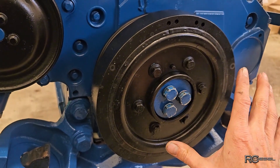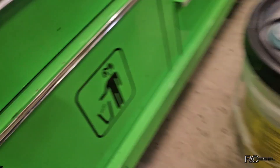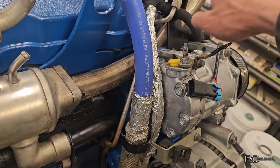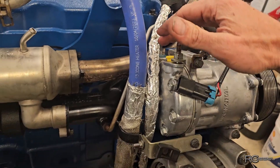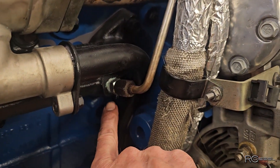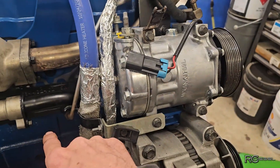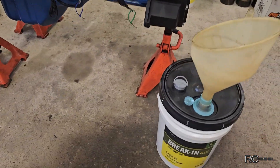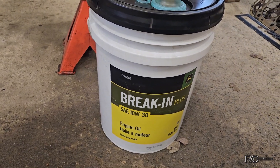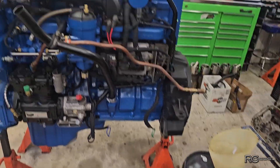This oil pump fiasco is finally finished. That little piece of pipe on the floor - that's for an exhaust back pressure sensor. I made sure it was all cleaned out, ran it up to the ultrasonic cleaner to get all the soot out so we don't have to deal with that and the sensor will work properly when this thing gets run. I had to change a fitting on it - the threads were wrecked - but that's done. Now I was working on getting it finished up, getting the break-in oil in there. I use the John Deere break-in oil quite a bit. I'm not a big fan of John Deere oil in general but I do like their break-in oil - it's not expensive, it's readily available, and it works good.